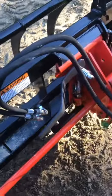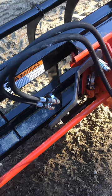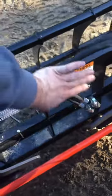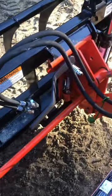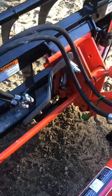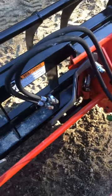Now they want to live over here, so when you have them off you can drape them over here and they don't try and pull this way. All I'm recommending is, on your hydraulic stuff when you get a new piece of equipment, check the line arrangement. You can simply loosen up the fittings and tilt them to the orientation you want, then tighten them. It doesn't hurt anything, doesn't change the way they seat — they're very precisely machined so that you can turn them and still be good to go.